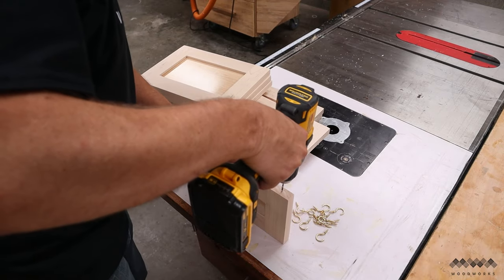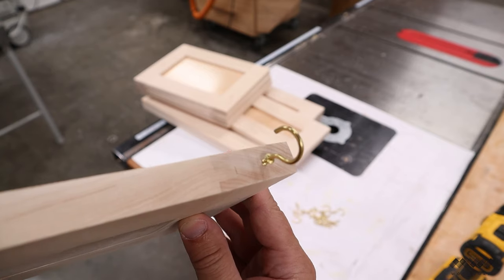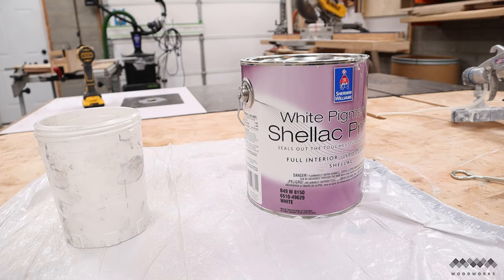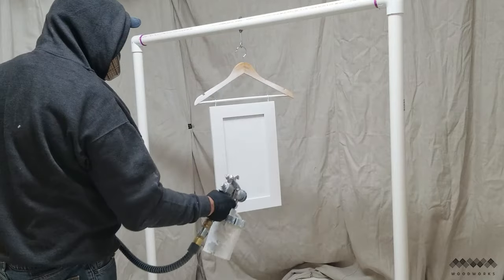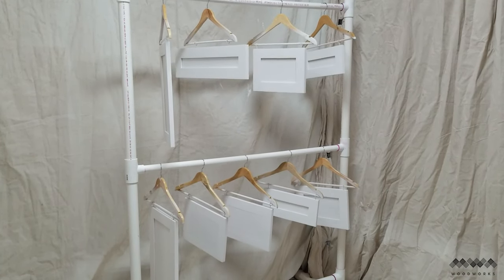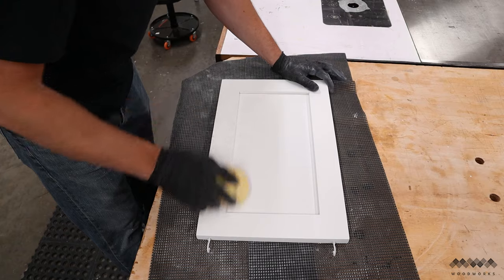While the concrete is curing, it's back to work on the fronts. After sanding everything to 180 grit, I added cup hooks to the bottom side of each front to help me spray them more easily — and the holes left by the hooks are on the bottom edge and will never be seen. The first thing I apply is a coat of shellac primer, which seals the wood well and prevents the wood grain from raising when exposed to water. I give everything a good coat of primer using my spray rack, then hang them to dry. After everything dries, I give each front a quick sanding with 320 grit sandpaper just to knock down any rough spots.